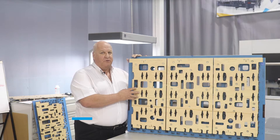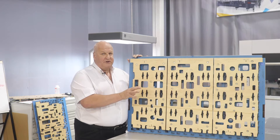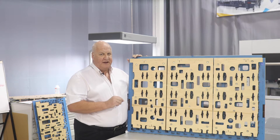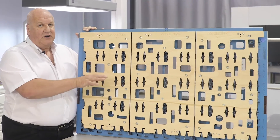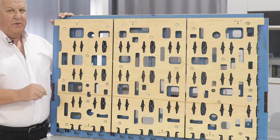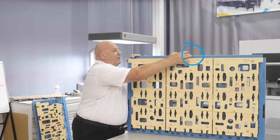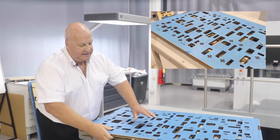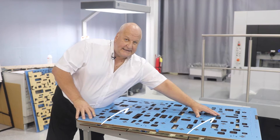This is the upper quick lock stripping tool, which can be made by your die maker. All the pins mounted on the board have been positioned for the most reliable removal of the pieces of waste, and the pieces of wood here — or you can equally use sponge — are there to hold the sheet flat prior to the stripping tool pushing down on the waste. Two details I would like to point out are the centerline block here; if I lower it down you can see it a little easier — this is the centerline block right here.